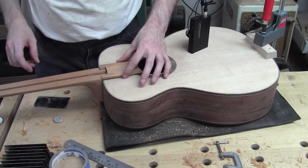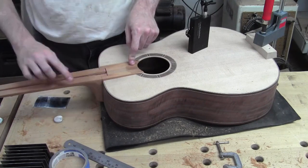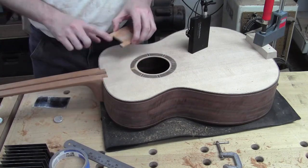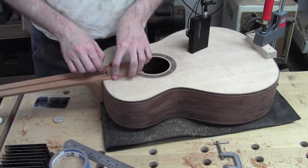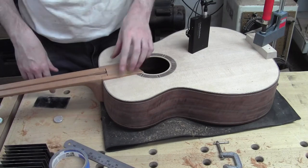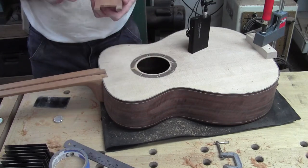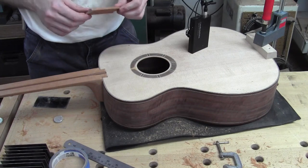So I've got this little shim, but it's a bit thick right now, it's oversized. And I need to taper this from this surface. This end needs to be flush with the top of this, which is not. It's up a little, about a 32nd of an inch, down to basically nothing. This is a tough little thing to grab onto and perform that very operation upon.